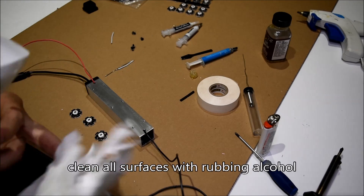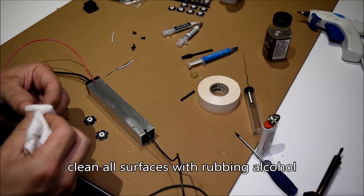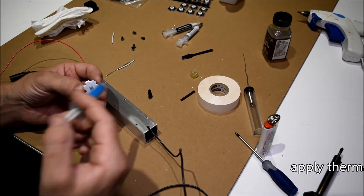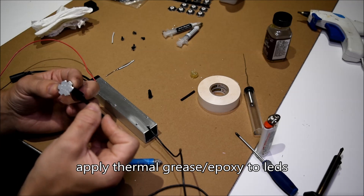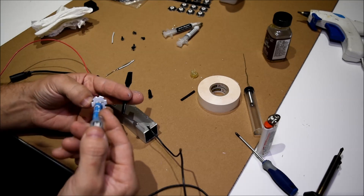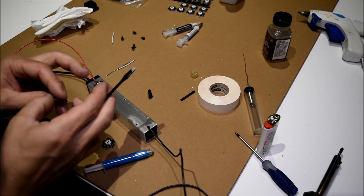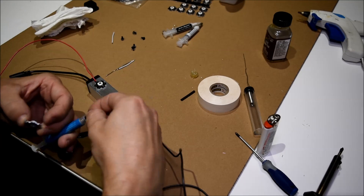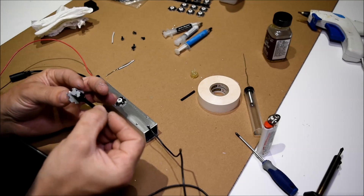You want to clean and prepare all the surfaces with rubbing alcohol. Even though this light's only going to be on for five minutes a day at the end of your flowering period, there's no reason not to have a good thermal interface. Here I'm using just thermal grease, spreading it out nice and thin and pressing the LEDs to get a good contact — you get a kind of vacuum contact there. If you don't want to screw-tap, go to Radio Shack or a computer store; for about $7 you can get thermal epoxy.